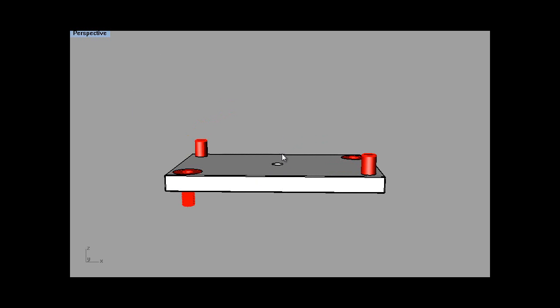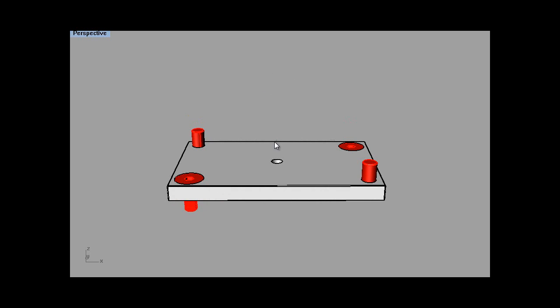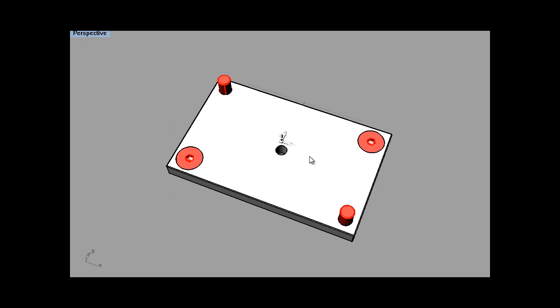And then in the chuck, you have either an upside down 1/8 tool, so the actual shank of the tool sticking out of the chuck, or if you can get a piece of 1/8 tool steel or metal bar, that's ideal. And this is an 1/8 hole that's drilled into here, so get that as close as you can, and then you can jog it, or you can actually turn the mill off, and move the spindles with your fingers, move the lead screws with your fingers until you can slide it in and out, because it's slightly loose in the hole. Once it goes in there without forcing it, you can zero your X and your Y. So that's basically putting your X and your Y in.